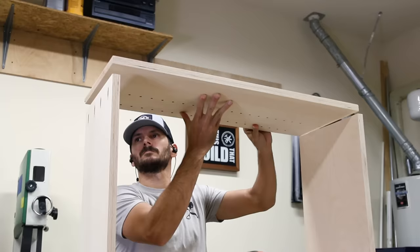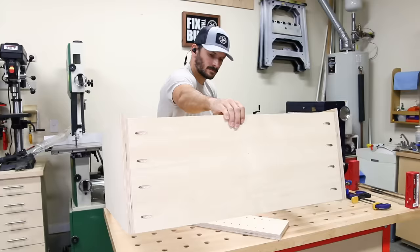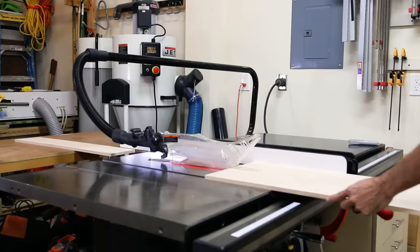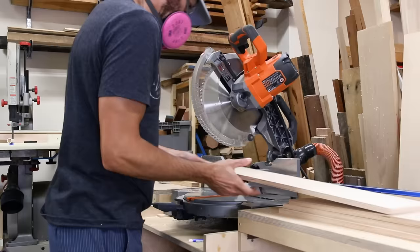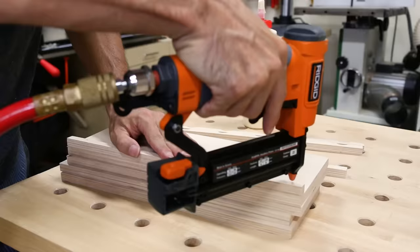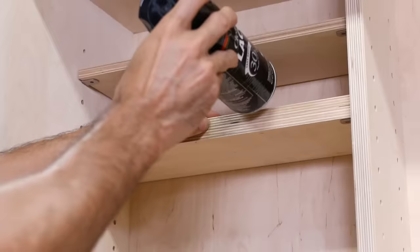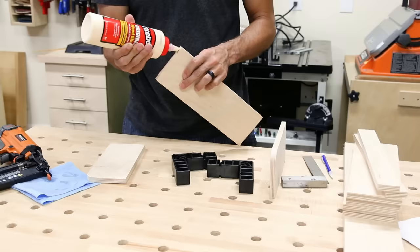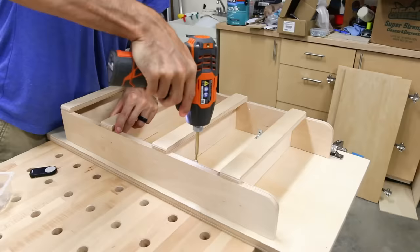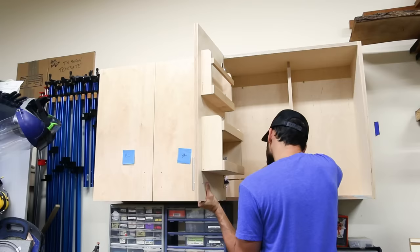For these wall cabinets I wanted something more than just a couple of full-width adjustable shelves. I made one cabinet to store my finishes and adhesives — big cans, small cans, spray cans, and a host of large and small bottles. I split the cabinet in half with half-depth adjustable shelves on each side. The right side has standard shelves for quart cans of finish, and the left side has custom spray can holders that take five spray cans per shelf. I made both shelves half-depth so I could put storage cubbies right on the doors and have access to everything at once when I opened them.